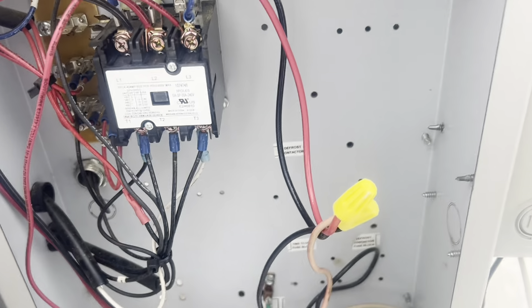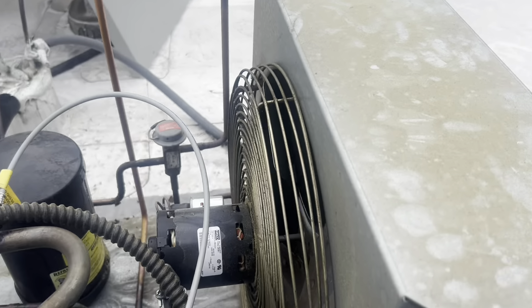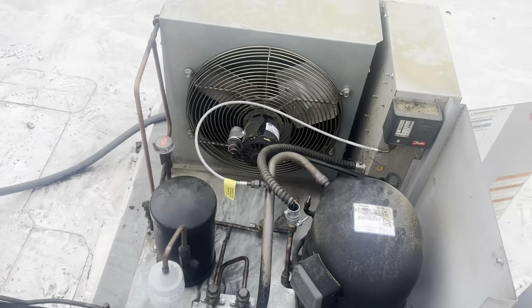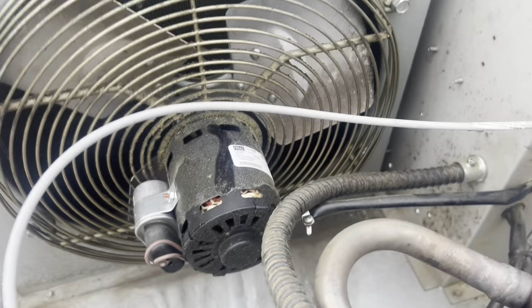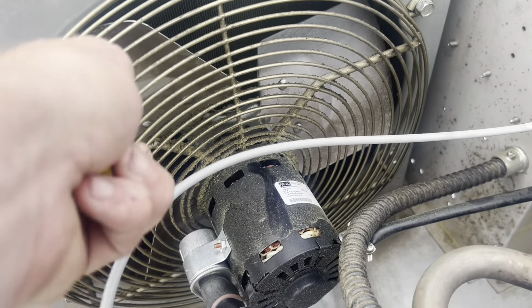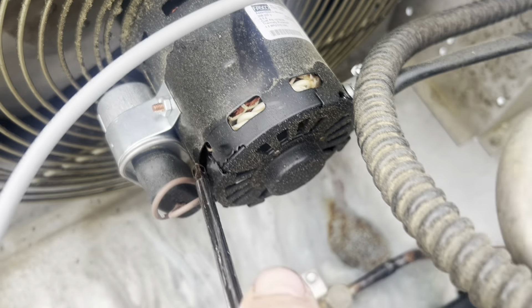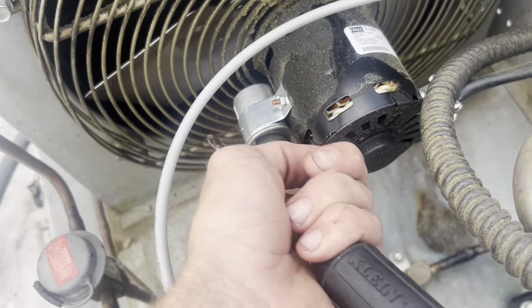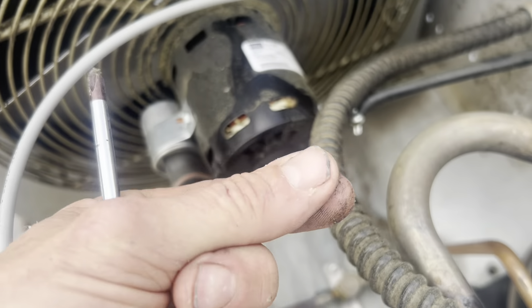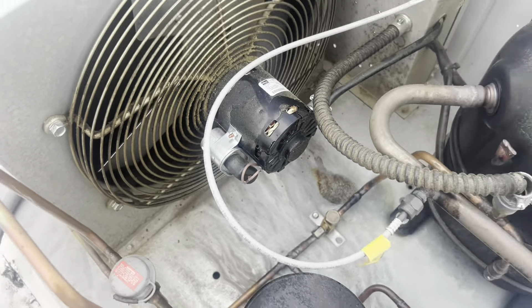She did just fire up. That's definitely got the sight glass problems. The fan also did not start — I've got to look at how it's wired in. When you look at how the fan's wired in, the fan comes in the upper. It runs the black wire straight to the contactor, white wire straight to the contactor. So when that pulls in, that fan should have run.